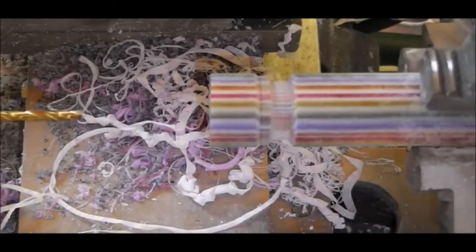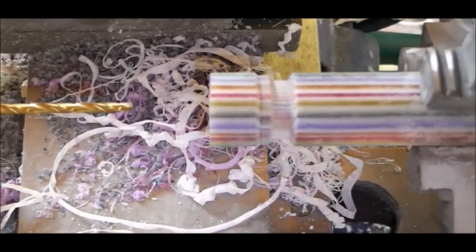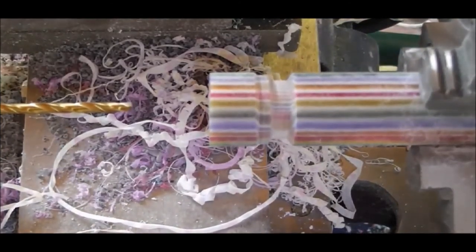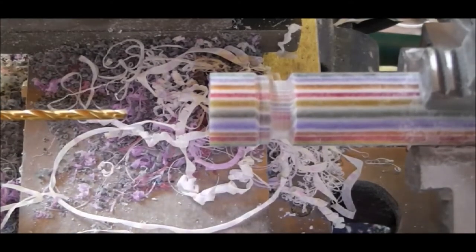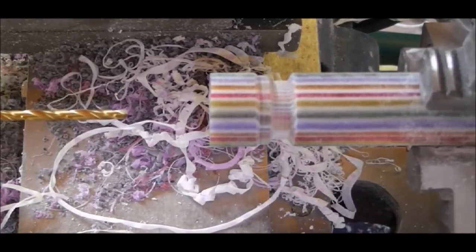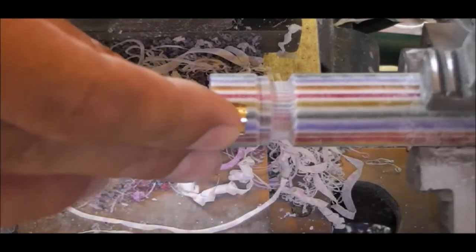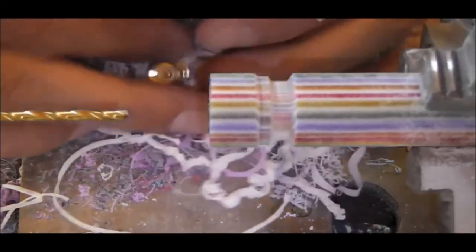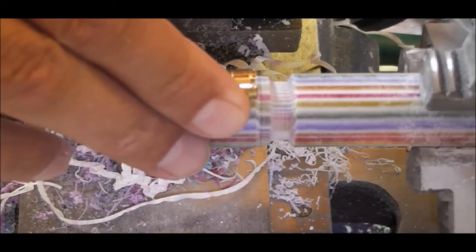Right, well, I've got my drill bit in. I'll just talk you a little bit through the process of how I'm looking at doing this. I'm going to be taking a small 3mm bit, taking it up through all the cuts and eventually out to a 9mm, where I can test fit the atomizer connection. Whoop, he's just lost in the top of there. And I may ream it out ever so slightly just so that it does sit fully home.